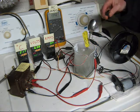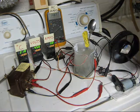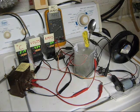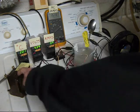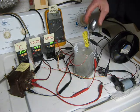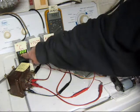And now we can connect also this string trimmer motor, which is obviously turning. You can hear it. Yeah, 1.5 amps and 1.52 or so amp AC from the outside legs of this. Almost an amp, 0.9 amp coming from this anode. I'm going to be real careful with that. About 4 1/3 volts, and you can see this is coming up the temperature a little bit.